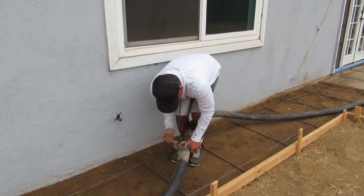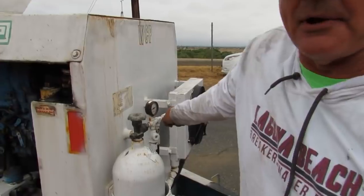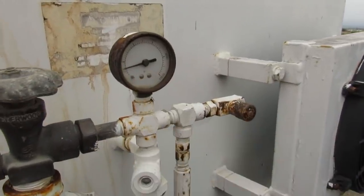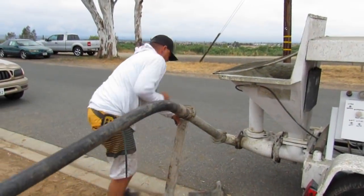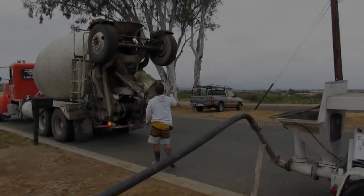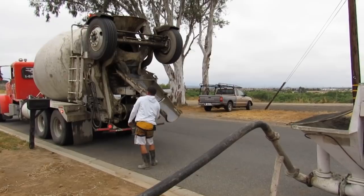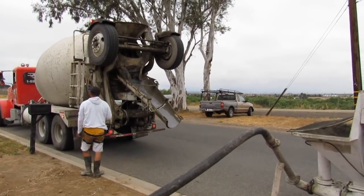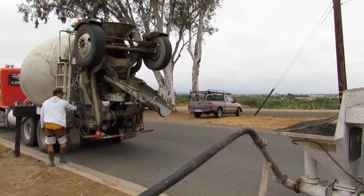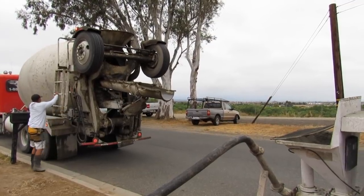Here's the nitrogen bottle. I've got about 150 feet of hose out and I'm pumping it semi-wet, so I put about 100 pounds of air on it. I run about five to seven gallons of water to prime it. Here's the truck — we're going to back him in. With an Olin pump you have to put a stick in it to hold the prime. Some people put a bag and just leave the reducer down, but I've been doing it the same way since day one and it works for me.